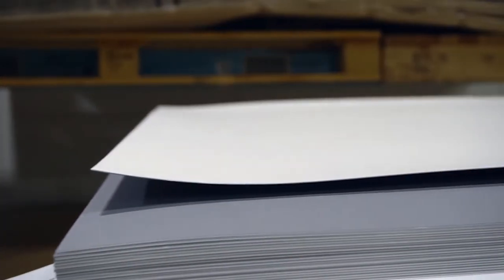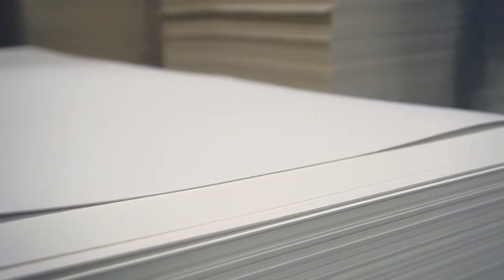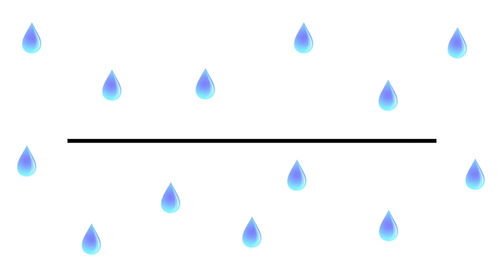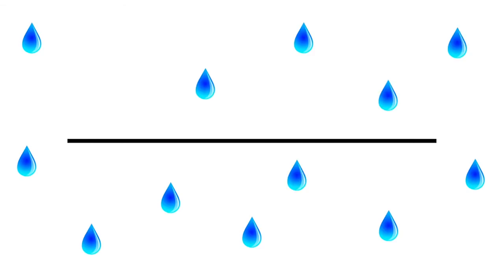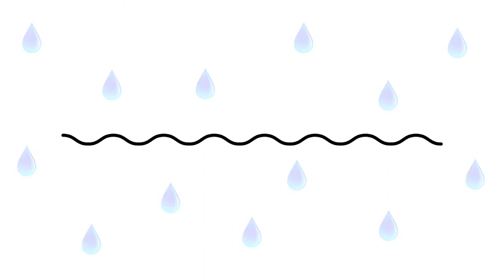If a matboard curls up at the edges, it is too dry for its surroundings. If a matboard gets waves in it like a roller coaster, there's too much moisture in the board and it must be removed. If there are slow changes in humidity over time, the board can acclimate at a slower rate and remain flat, adjusting to the changing climate. On the contrary, if there is a dramatic spike or drop in humidity, the boards will warp or curl, making them difficult or impossible to use.